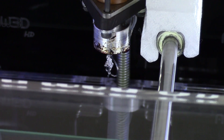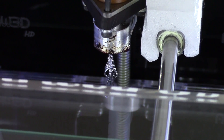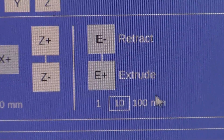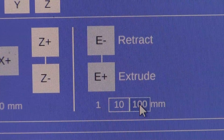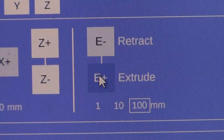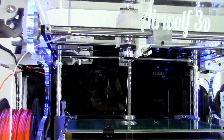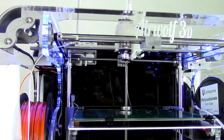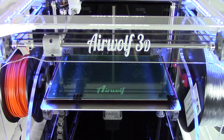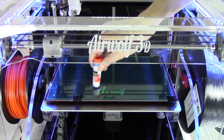We will now remove the previous material and insert the polycarbonate filament. Push it all the way up into the tube until you see it start extruding outside the nozzle. In MatterControl, click the 100mm increment and hit E+ to extrude 100 millimeters. Do this a few times until you see the previous material completely gone from the head — you want to see a nice clear flow of polycarbonate.